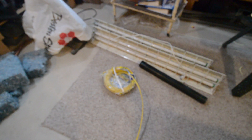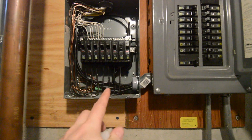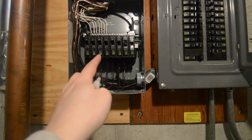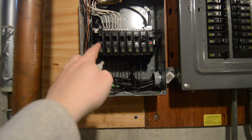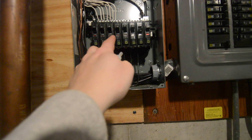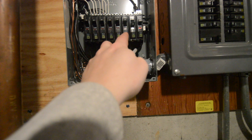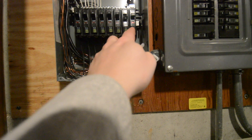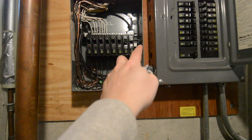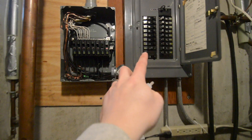I'll make the wire long enough, cut it, put it up in the rafters, and get it over to the fuse box. I turned the fuse box back on for the sub-panel. I ended up moving the breakers over, so now it goes: music room lights, music room power, the wall between the tool room and the music room, tool room lights, tool room power, workout room lights, workout room power, laundry room power — and I'll probably leave the current lights on the circuit they're on, which is coming off the main fuse panel.